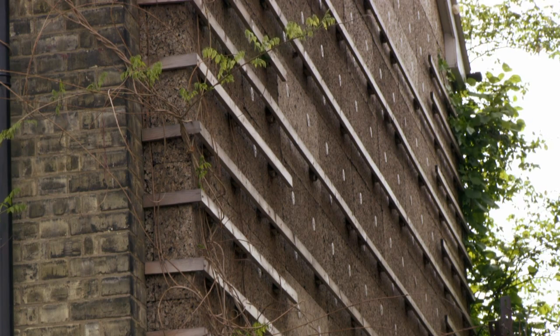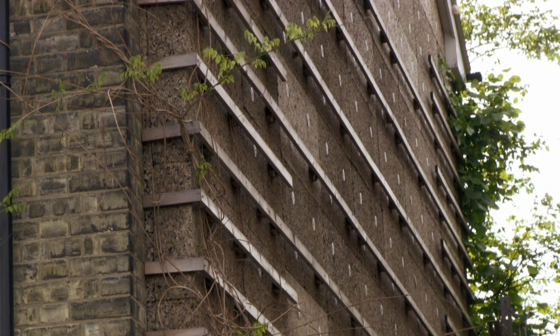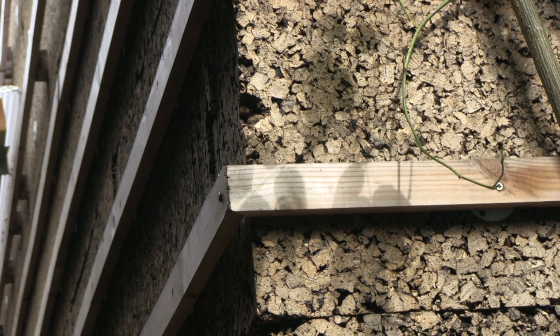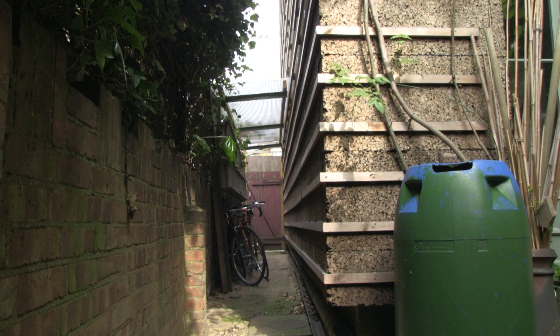On the side of the house, as this is a semi-detached house, we've insulated with 180mm of cork in two layers — one layer of 150mm and another layer of 30mm. And then internally we've used 120mm of cork, which was then covered in mesh and then plaster skimmed. Whereas on the external wall insulation, we've left the cork in its natural state and not rendered it.